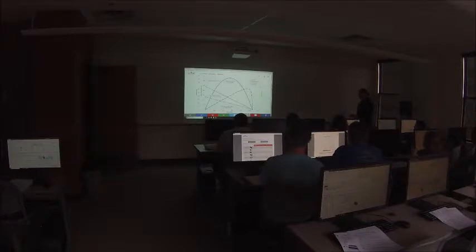So let's talk a little bit about why the motor behaves this way. Okay. Why does the torque decrease as speed increases? So if I have a motor, I'm going to draw a diagram and I'm going to butcher it. Okay, so this is a circuit, right? This is a battery, negative side here, positive side here. Current flows from the negative side through the motor and back to the battery. Okay, this is essentially what's going on in our robot, right?